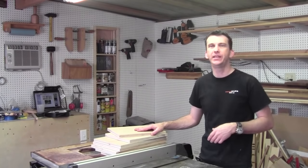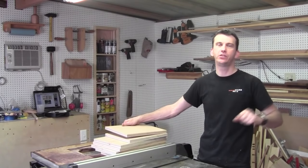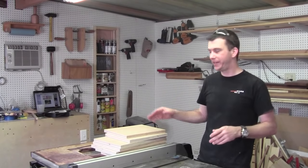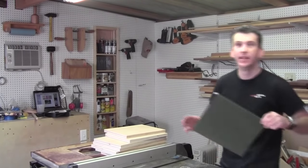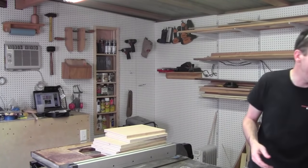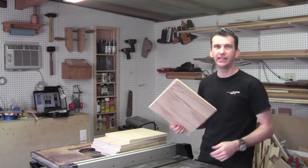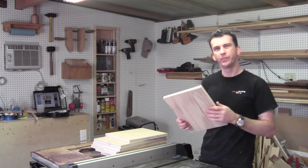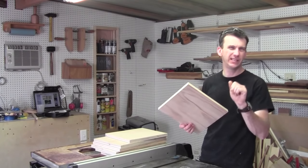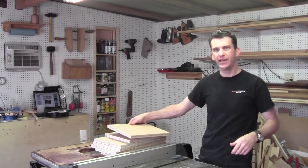Before I cut the rabbets into the four side pieces, I need to cut the groove in all of the drawer parts at the bottom for the bottom panel. I'm just going to use a quarter-inch oak panel — about 3/16 of an inch thick. I want to make sure that where I cut my groove, there's enough room for the little dividers that hold the folders, files, and documents. I've got a single blade in here. I'll make my groove cut, slide the fence over a little bit, and open it up wider until I reach the right depth — about 3/16 to a quarter inch. I want a nice fit — not too tight, not too loose — and then we'll move over to the rabbet.